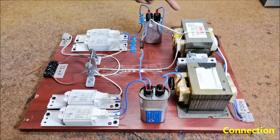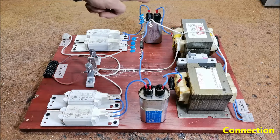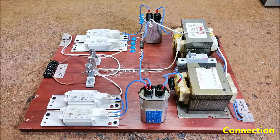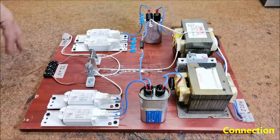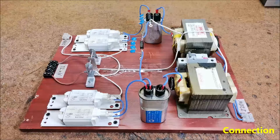Capacitors are connected to the other ends, and two diodes are connected in series to them, the middle of which is connected to ground. In Greg's circuits, two 100 ohm 100 watt resistors and one nanofarad 10 kilovolt capacitors are used in parallel with the diodes that form an RC low pass filter intended to attenuate any radio frequency feedback from the Tesla coil. These feedback signals can momentarily damage the high voltage diodes.